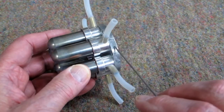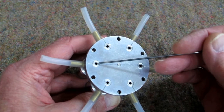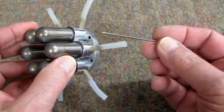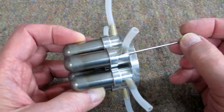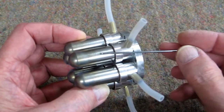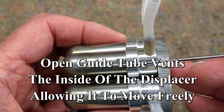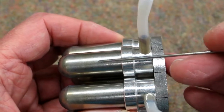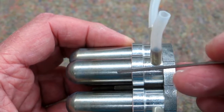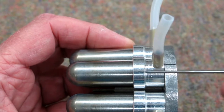This part is pressed into this aluminum plate, and that's that outside ring. This inside part is a tube and it's pressed in there, and it extends up in here. If I hold this vertically and push this rod in through this tube I can lift that displacer up and down. I don't want to do that very often because I'm not really sure what that displacer is made of — it could be glass. This tube is open on the end and connects to the area that's inside the displacer. The silicone tubes connect to the area that's external to the displacer. So the displacer is not a piston — it travels back and forth, and there is some air flow on either side of it.